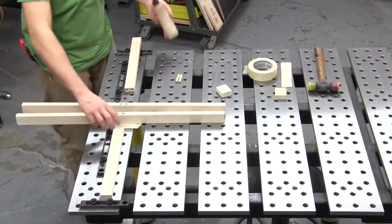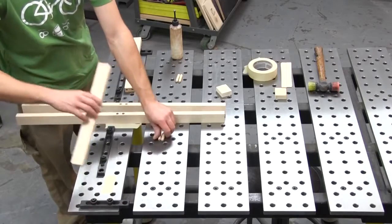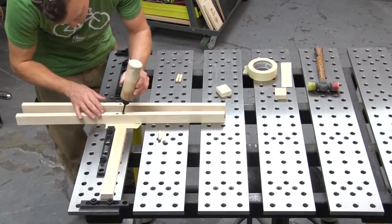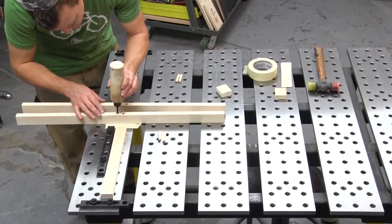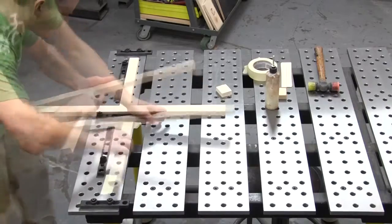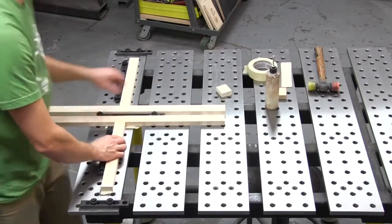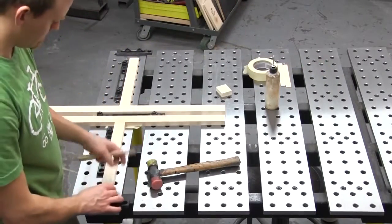With these straight edge stops, I could position two members back to back, glue them up, clamp them, go on to the next set, and I could actually fit 6 on the table at one time. And by the time I finished clamping up the 6th member, I was ready to pull the first one out of the clamps, so I could just flow right through the process.